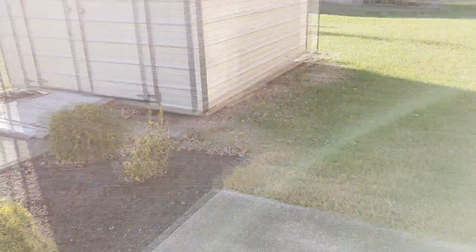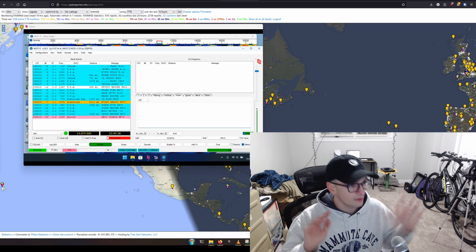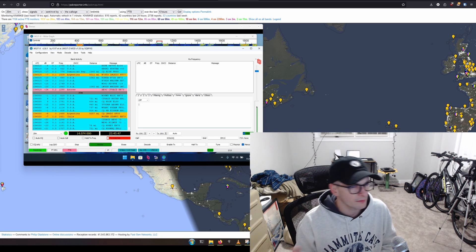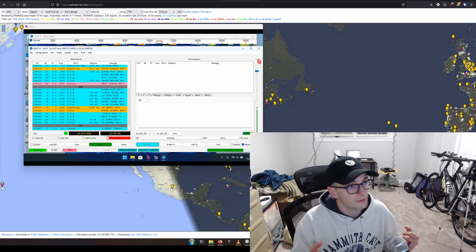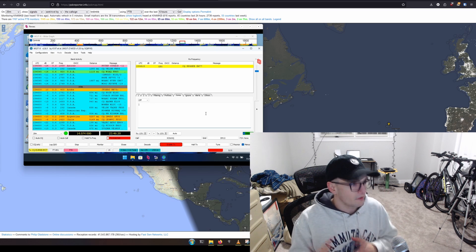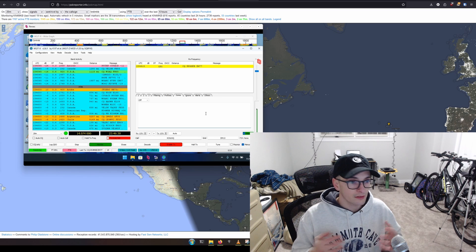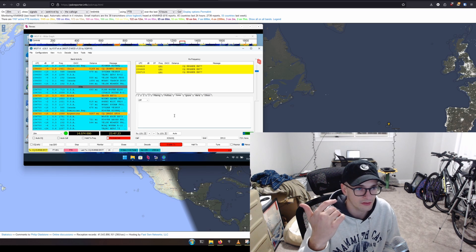It's time for an assessment. The antenna feed line part is probably only about two feet off the ground, and the highest part is probably about 40 feet, so not a perfect deployment. We're going to throw out five watts on 20, 40, and 80 meters here at 7 PM Eastern time from Kentucky and see where our signal goes. We'll call CQ three times on each band — if somebody replies we'll finish it up — and then we'll check propagation over on PSK Reporter. Five watts on my FT-891 is a good test to see how efficient the antenna is.